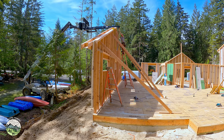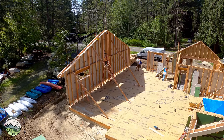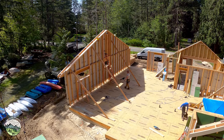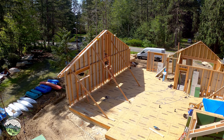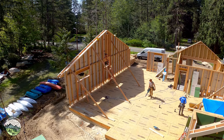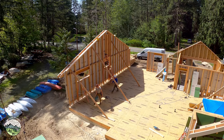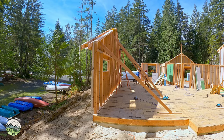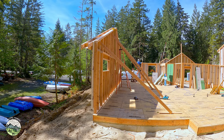We framed the rake wall and the adjacent walls ahead of time — you can see one leaning up on the right. Those walls were already built so we could immediately grab them and drop them into place, getting our corners and outside edges all braced up. We've learned not to build the big wall first and leave it up there for a week. We build all the other walls, set them off to the side, then put it together like a puzzle. Make sure you have room — that's our number one priority. We like to start in the garage, build all those walls, and then work towards the big wall last.